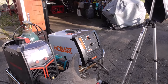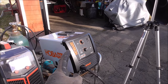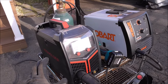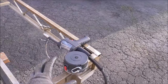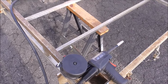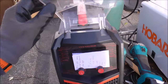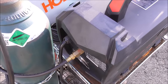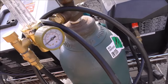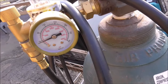The Hobart 140 is a 120V machine — we could easily do this repair with it, but the problem is it has a short whip. If you want to know how to MIG weld aluminum with just a standard MIG welder, I have a video linked above. The reason I'm using the YesWelder for this one is that I've got it rigged up with a spool gun, which has a fairly long whip so I can move around without worrying about kinks. Since we're welding outside, we'll have to turn our gas up a little higher than usual to compensate, though it is pretty still right now.